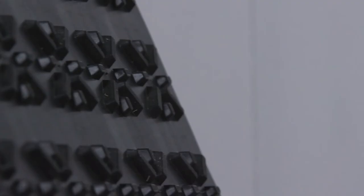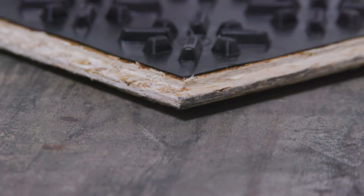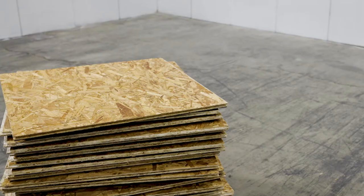A Dry Core subfloor is an all-in-one thermal and moisture barrier that sits under your floor and on top of the concrete. Concrete is porous, so moisture gets in, which can contribute towards mold and mildew. Cold gets in and you feel it on your floor, and without a subfloor the surface feels hard and uncomfortable. All in all, putting finished floor directly down on concrete is a mistake.